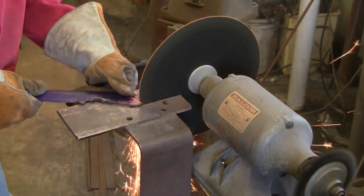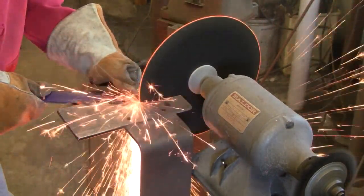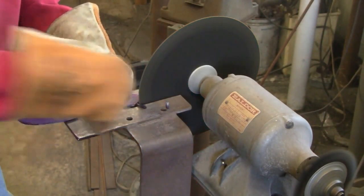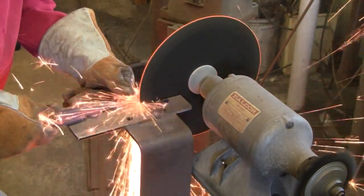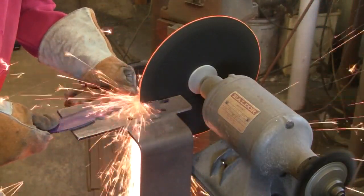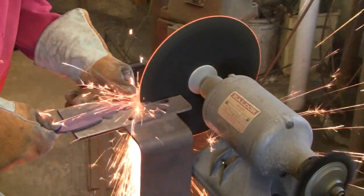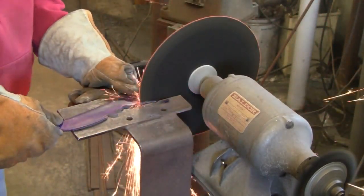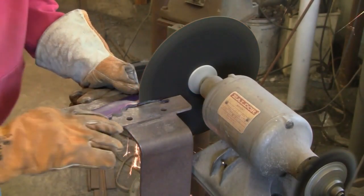Hopefully this will give you some ideas of what you can do to get started with your knife making. It's a good deal to wear a cotton mask. I've got a fan over there that's exhausting and blowing out all the grinding dust out the window. Get some fans going to help bring in fresh air and blow out the grinding dust.